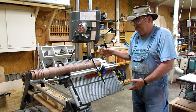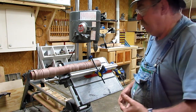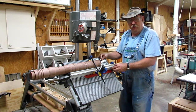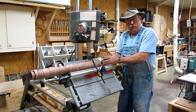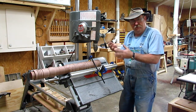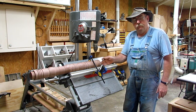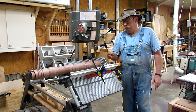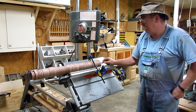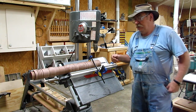I don't know how many of you ever saw one of these things in operation, or if you ever seen a demo. I guess there's always a demo and something about Shopsmith. But on the drill press, you put your fence on here, tilt this thing up, and you've got a perfect V right here. You can adjust this way, up and down, and the angle. Anyway, you've got a perfect place to lay a round piece of stock in here and bore a hole in it. I mean, you can't get this set up on a normal drill press. And it works great for this right here, among other things.